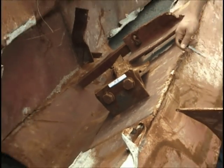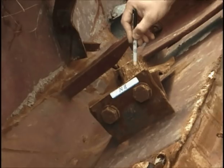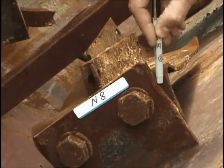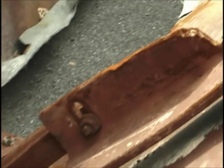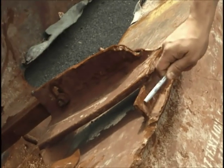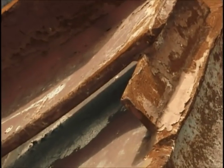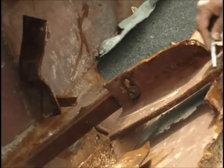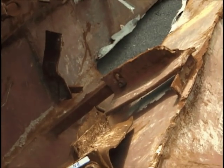This is off N-8, off the left column, the bottom flange. We'll be removing a piece from this corner right here for metallurgical analysis. Also, we'll be removing a piece off this portion of the flange right here, and either one of these two corners right here — whichever we can take off — for metallurgical analysis.